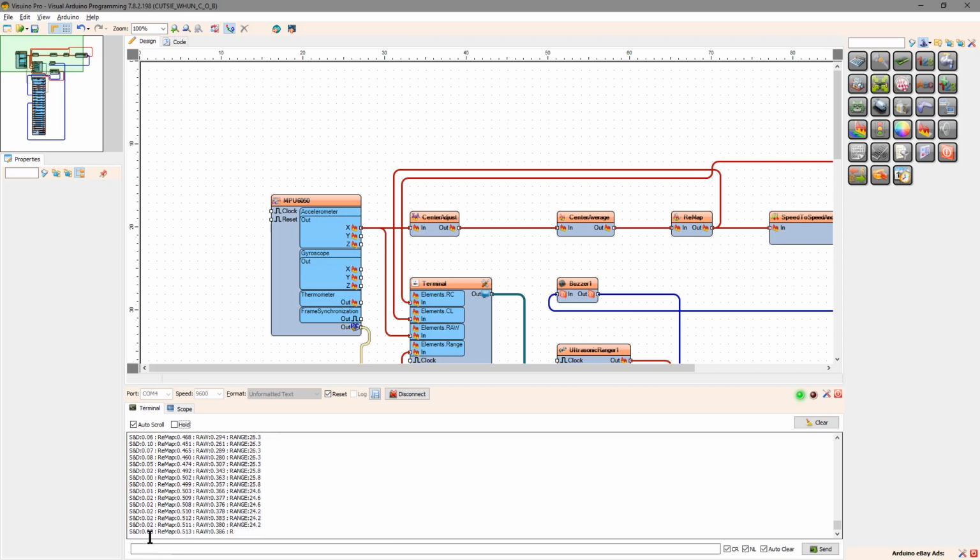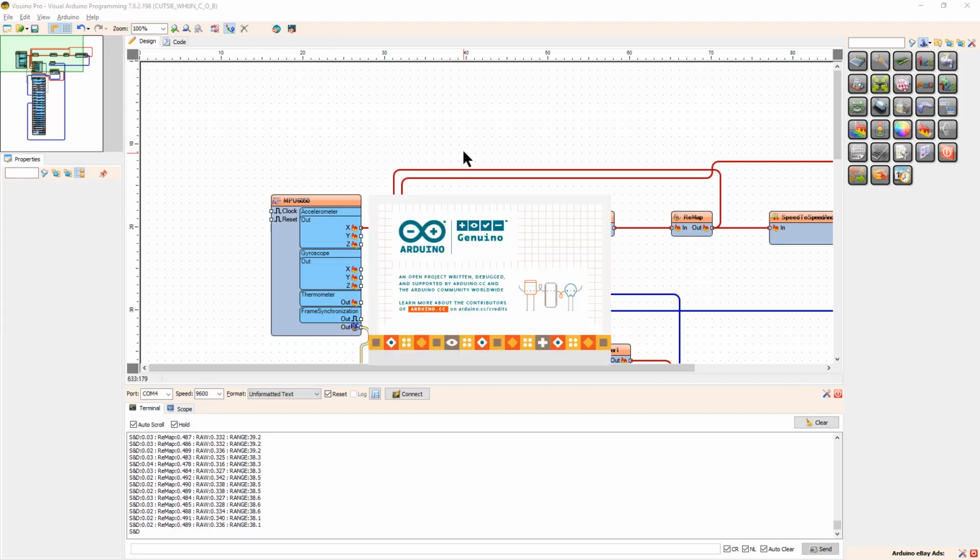Alright, now if you need to tip it left or right, all you do is you press hold again. You find where you gotta be. Alright, press hold. And then you highlight the raw. Only the raw. And then you copy it. Find your center adjustment. And paste it in to the center adjustment. And then reload it. And that is how you tune the PID roughly.